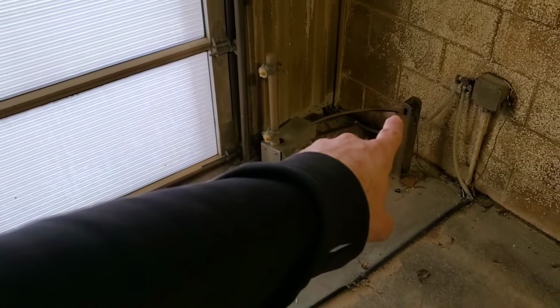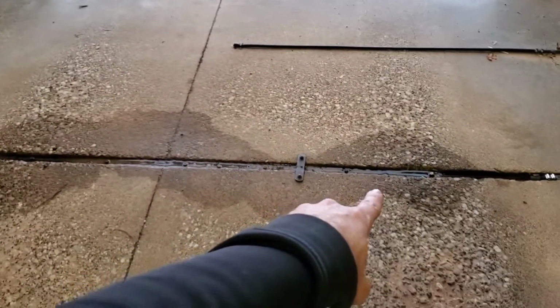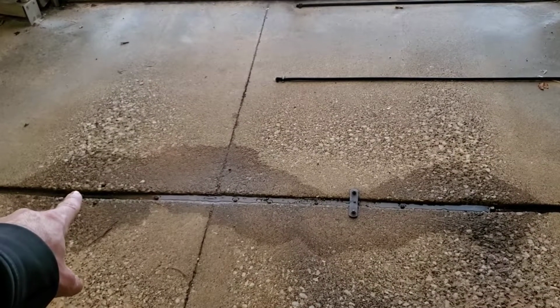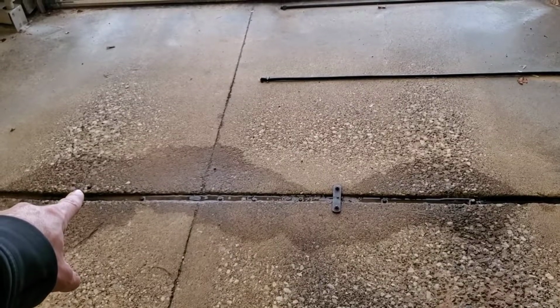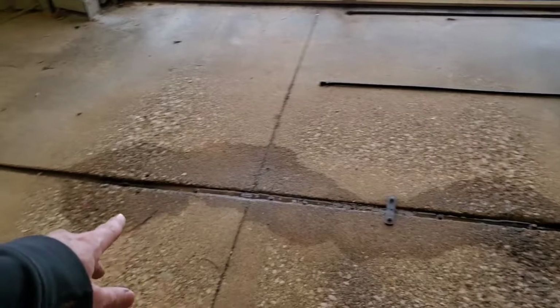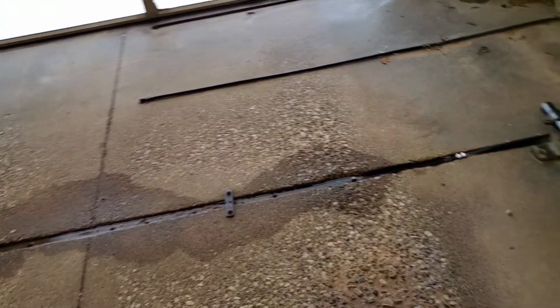And then when you cross this beam that starts here and ends up at this upper one, it'll activate this underbody sprayer here, a series of 6 nozzles powered by a big pump in the back room. And you get about 10 to 12 seconds of spray, which can be programmed to last. You can adjust the time duration for that, but I think I need a scan tool for that. I've always just left it where it was when it was new, which is about 12 seconds.